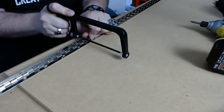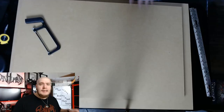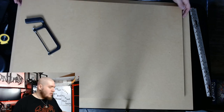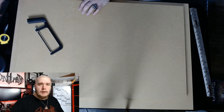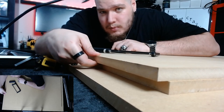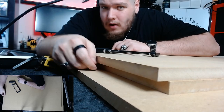Let's go ahead and get started by cutting and attaching our hinges. The idea is to have the front piece the same size as our poster and the back piece to look like a frame around the poster, so we want the front piece to have a 2-inch border all the way around. The middle piece is where it gets a little tricky — we want it to be sunk in the same depth as one of these boards. That's why this one is three-quarter of an inch shorter than this one.